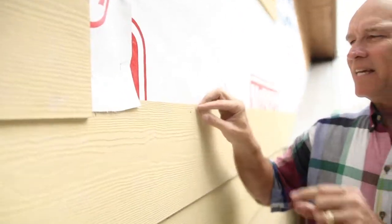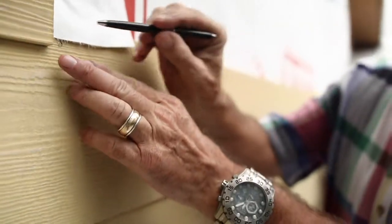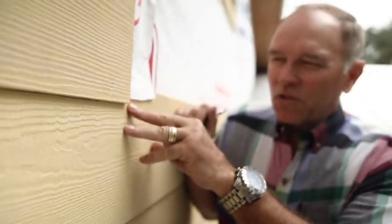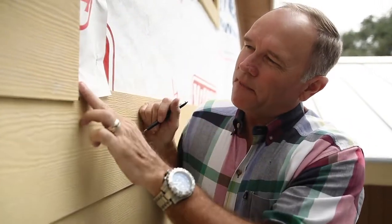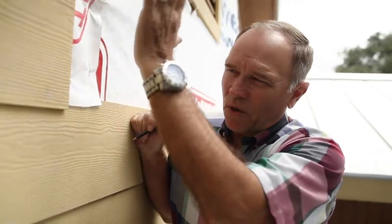It is really, really tight. If you look on top, you can see how tight it is. Show them right there, Justin — how tight that is to the siding. So it's not only driven up tight, but the nail is really tight too, and it allows the next row to lay down really flush because there's no nail sticking out. And it's not over-driven either. If it's over-driven, then it starts to break and fracture the hardy plank siding. So this shim is a waterproof shim — you simply put these in at every joint and it works great.